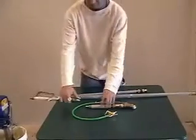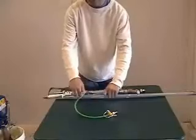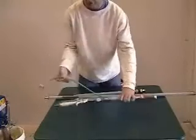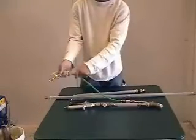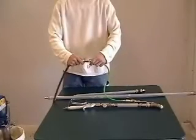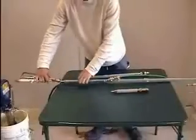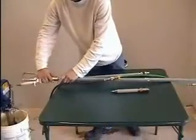For texture, attach the texture pole to the quick connect. You will also need to use an air compressor and air line to deliver and break up the compound to your desire. Attach the air line to the texture attachment. The texture attachment may also be used on any tube length.